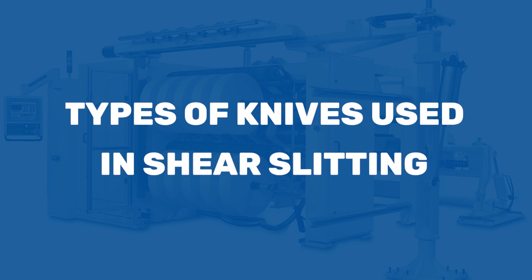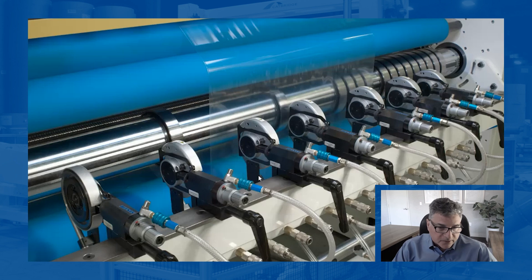With shear slitting there come different knife styles, different blade angles, different blade styles — they all have a purpose. When slitting foils, we typically use a double hollow ground knife. Slitting plain papers, we use more of a standard knife. Slitting thick films, we use a wide rim knife. When you shear cut, you've got to displace the material and it has to go somewhere. Depending on the material type, it may create a raised edge, and you need to work around the knife style to get the right result. Wide rim knives displace the material so it goes around — great for thicker films like thermoform.